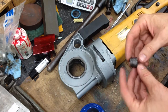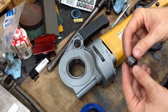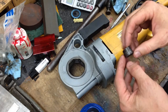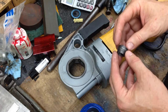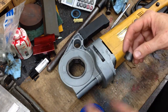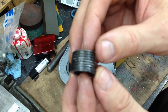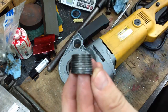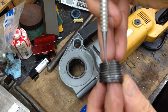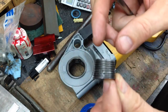My framer got himself in a situation with a Sawzall and cut into a brand new gas line. We had it pumped up with compressed air, so no harm no foul except for the pipe. I thought easy peasy, I'll run home and crank out one — a custom size, like 55 inches. Fired up the Harbor Freight and of course the dies did what they do best and chewed the pipe to pieces. Threads are missing throughout — part of the thread is missing here, missing there — it always does this with half inch or three-quarter.